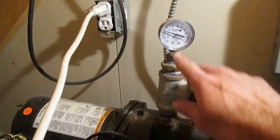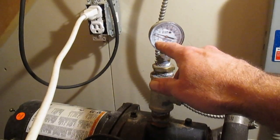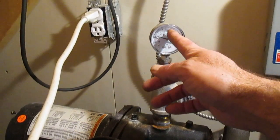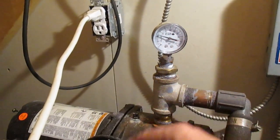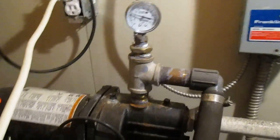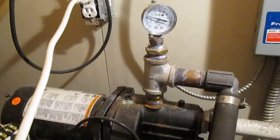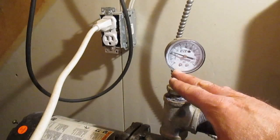This one is set — I have the one for this house set to 50 psi. So it should build pressure up to 50 psi, and then the power should be disconnected via the switch and the pump won't run anymore. Then it'll stay at 50 pounds. People use water in the house, the gauge will drop, and when it hits about 30 the pump should come back on.